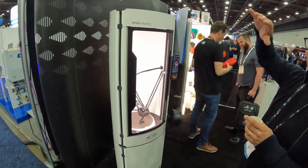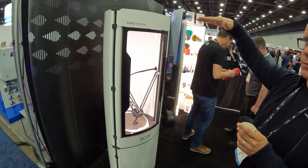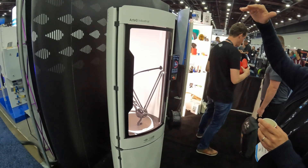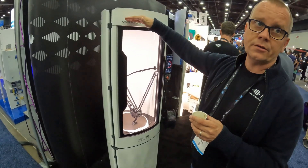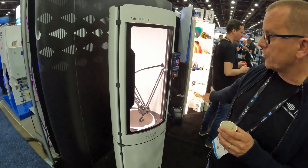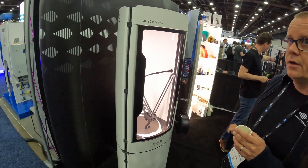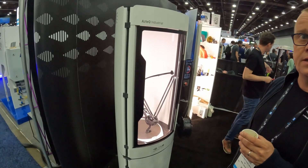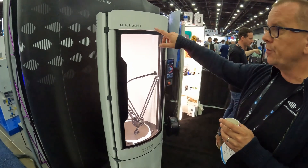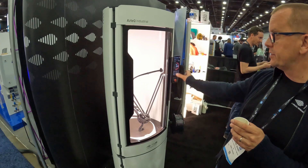It's custom — two boards. The main board is a Duet, which we've historically used, plus a second board like a Raspberry Pi but made for us to handle all the communication. With this print volume we already need 32-bit processing, especially with delta. The communication board handles Wi-Fi, and I'm looking at it — that's a cell phone! You can run it from your phone via Bluetooth. It's our own application — we chose Bluetooth to be Wi-Fi independent.